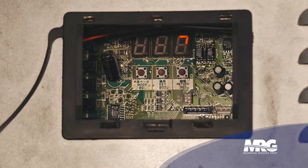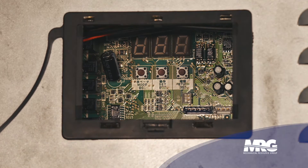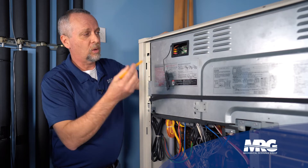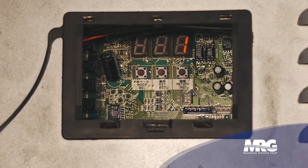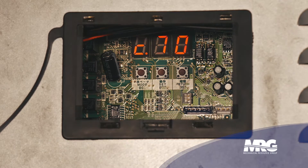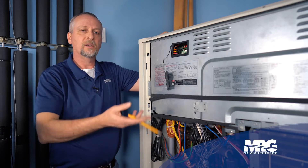Now I am in emergency operation mode to lock out the primary compressor. The zero showing right now tells me that operation mode is turned off. If I want to turn it on, I press the set button — it goes to one. One means yes, zero means no. I've selected one, but I haven't locked anything yet — I've just scrolled to say I want to lock this one out. Now I'm going to press the return button twice. Return once locks the setting in; return a second time activates that setting. The primary compressor is now locked out, and the condenser can start and run on the other compressor.